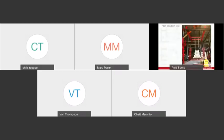For the gearboxes, we reassembled the same gantries in a different location just adjacent to the mill stands. And for this scope, the gearboxes came in a different plant entrance via the trailer. We offloaded them with our 500-ton one-shots and then set them onto our 100-ton slide system and slid them from the area where they were able to come into the building over to our gantry arrangement that was set up on the other side of some columns, that would then take the gearboxes and translate them over to the final set position.